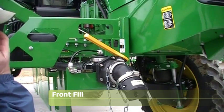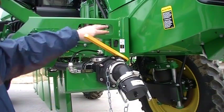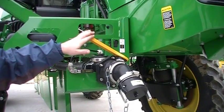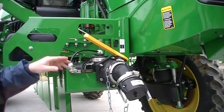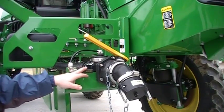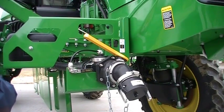This is the front fill valve here on the front of the sprayer. To use this we're going to open up this valve, turn the switch on, and fill the solution tank up. Once we get done we'll close this yellow valve and turn our switch off. Then we're going to open up our air purge valve — this is going to purge the whole line back to the solution tank. Open it up for about 10 seconds, then close it back down once the air gets purged out.